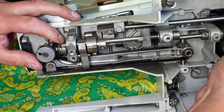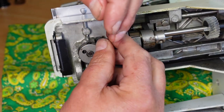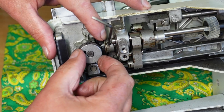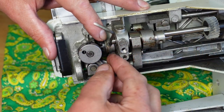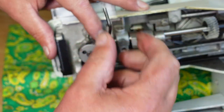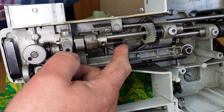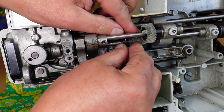Now let's get the screw in on the flat on this here — the screw is going to tighten on the flat surface there. You want a very small amount of backlash in this gear here, and you can see that if you take the gear to the right on the horizontal shaft there's a lot of backlash — that's way too much. So you want to bring this gear to the left so there's minimal backlash; you don't want it to be tight on that gear. Then you tighten this screw here and check your backlash. We can see we've still got no drive because this gear is loose still and not engaged — this is the feed drive — so pretty much just slide that gear across.